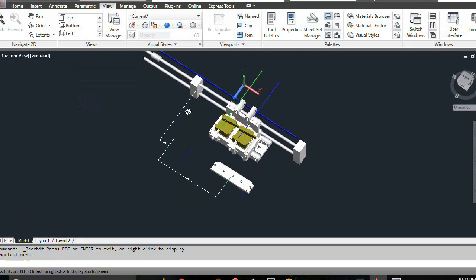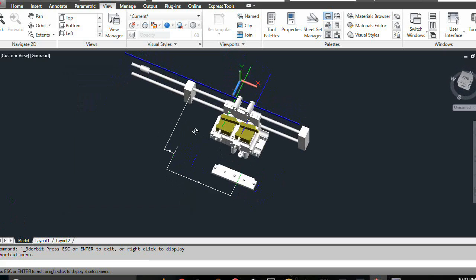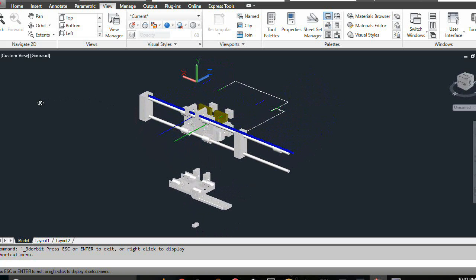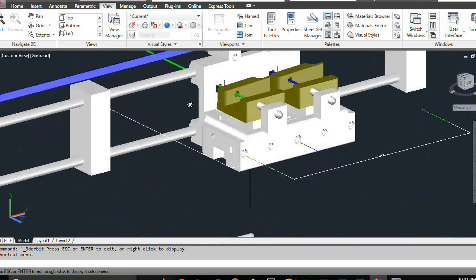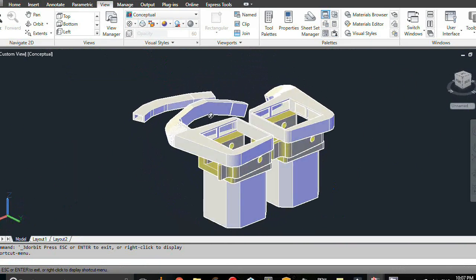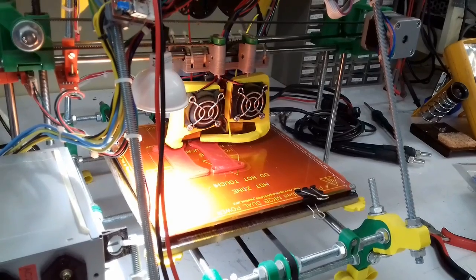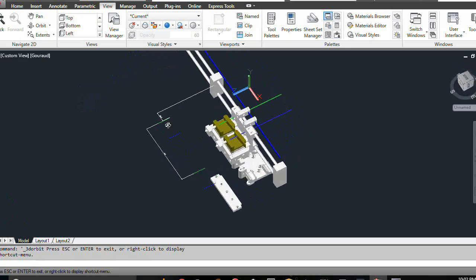Let's start with the first part. I designed myself a dual MK8 extruder. This dual extruder is also fitted with air ducts that use the air from the hotend heat sinks. They don't need an extra fan, and this saves some of the total mass of the extruder. Although this was initially designed for the Prusa i2, it can easily be adapted to the Prusa i3 as well.